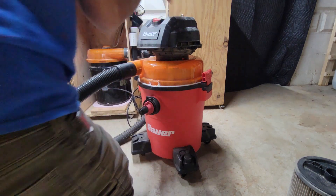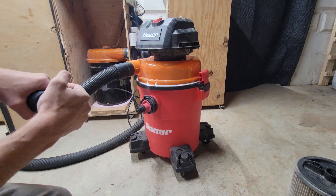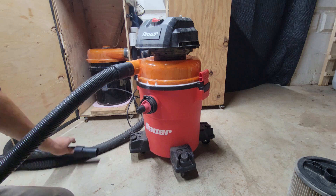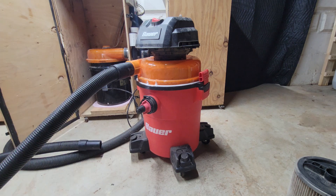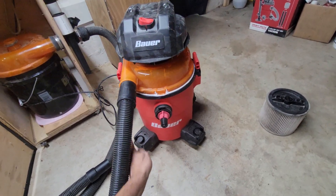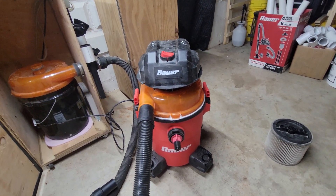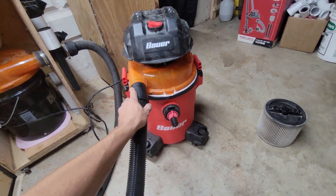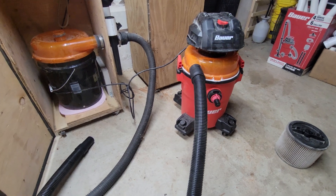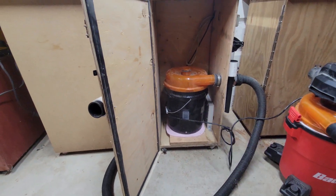Watch your ears. So I thought that was kind of cool. You can eliminate the bucket altogether, come off here with some PVC legs with a tabletop and make an easy sanding station — whatever you want to do. Obviously I probably wouldn't want to do that indoors because it's not filtered after the dust stopper, so the super fine particles will get through, which is why I have mine in a cabinet.